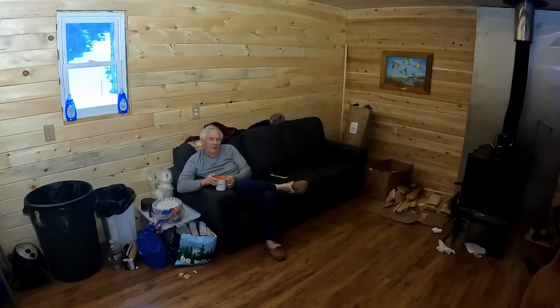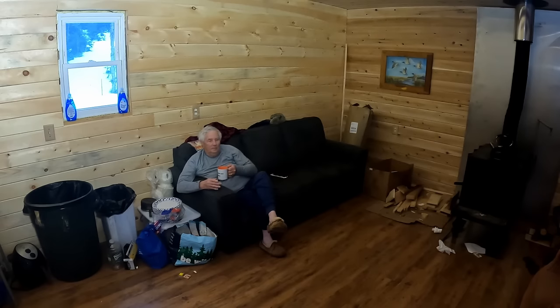I already put the toilet out there — it smells, all set up. The composting toilet comes with a little stand you have to climb up onto to get onto the top. It sits up high. You can't put an elbow in the vent pipe, it has to go straight out — otherwise if there's ever an issue they'd say the elbow caused it and void the warranty.